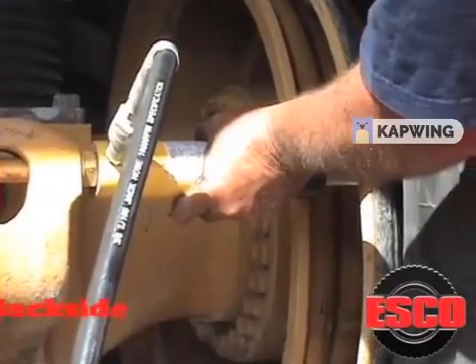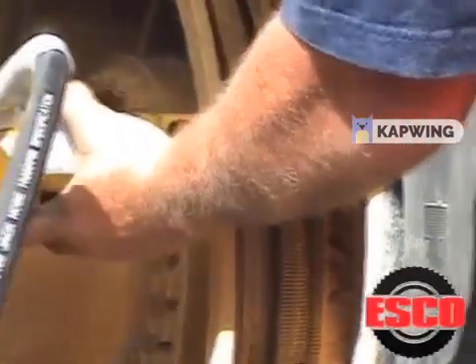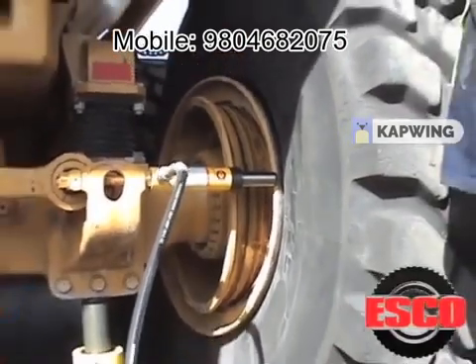When breaking down the backside of the wheel assembly, a 10-ton or 30-ton ram is placed with the bottom side against the frame of the vehicle, and the piston rod is extended against the rear flange, loosening the flange and tire from the rim base for removal. Again, this process may have to be repeated on different locations of the wheel assembly.